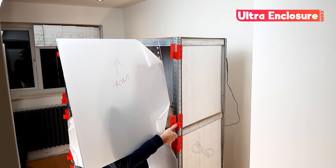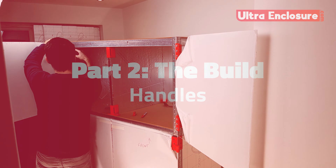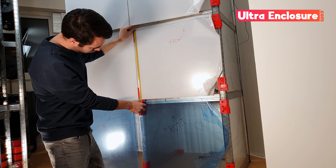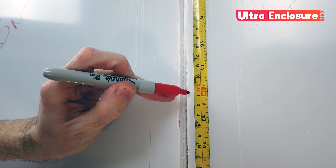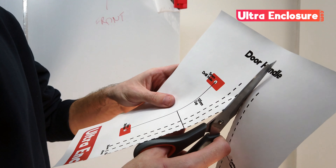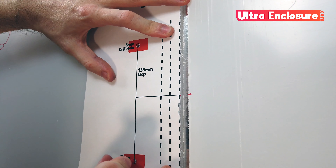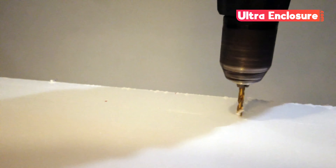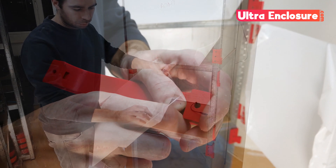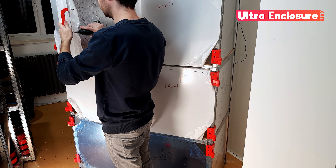If you've chosen to buy your acrylic custom cut the process is very similar — the only difference is that you have to measure all six openings at once and we need to account for the gaps without using spacers. You're on the home straight now — I'm going to add the handles next. Print out the drilling template file and make sure it's at 100% scale. Start by measuring the center point of the door. Depending how far in you want the handle, cut the template at the desired line. Now it's just a matter of lining it up with the center and marking the two drill holes. I'll drill them out with my five millimetre drill bit from the front and again countersink from the back. I can now push two captured nuts into the handle, pull the plastic away from the door and screw them into place. Five more times and all of your doors now have handles.